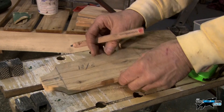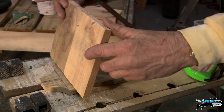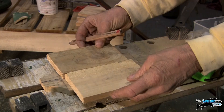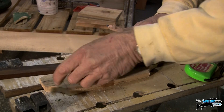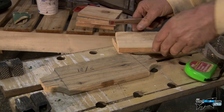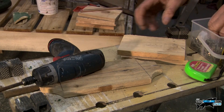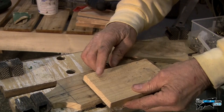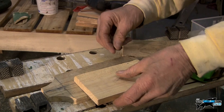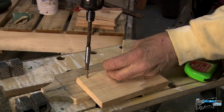I've got the back plate sanded off now. I'm going to put the back wall on — two pieces joined together, kept low to line up with the curve. I measured the centre line and marked it. I'm going from the inside out with the screws, no need to countersink because the wood is soft — it'll just sink and bury. Set the torque quite low so the head buries nice and flush.